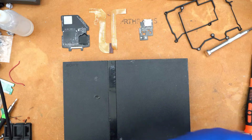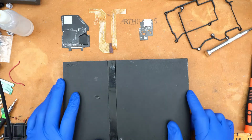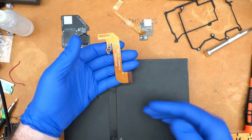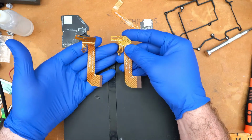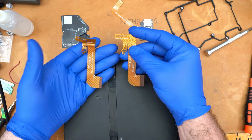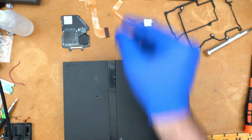Alrighty. So, y'all know what we're here for. We're here to test out the new complete iFlash2PS2 kit. That's going to consist of a new flex cable, which is updated from the old flex cable, which I have one of here. Changed some of the dimensions, changed the design of some pads that were a little bit fragile on the original design, and overall just made this better. So this is hopefully gonna be the release candidate for actually selling these flex cables.